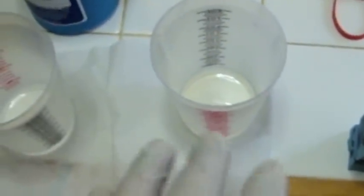Here I'm going to demonstrate how to pour the liquid plastic or resin. You can see I have the two-sided mold ready with the rubber band nice and tight. Make sure you line it up correctly with the registration keys. You have your pour hole ready — follow the directions of the product, always wear your latex gloves. Mix at a one-to-one ratio. Once you mix it you have limited time because SmoothCast 300 cures in about 15 minutes, so make sure everything is set up before you start. Pour it in through the vent hole, then wait 15 minutes.